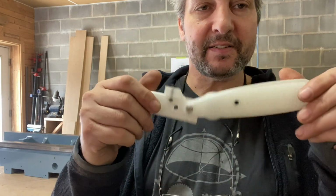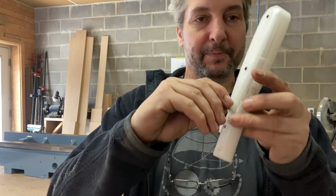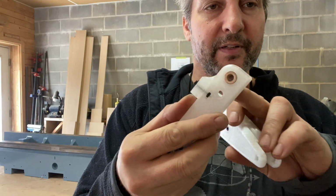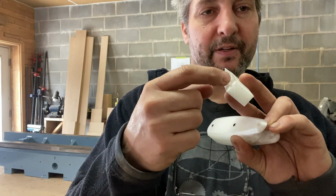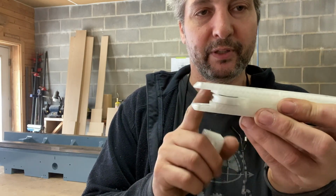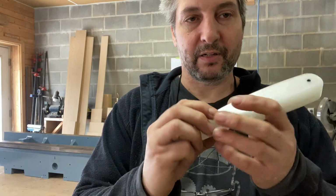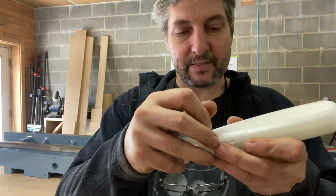Also, I've designed this little bender. It's pretty neat. It can be dismounted quite easily. You just pull out this shaft here, and there are brass inserts, and this part here holds the copper tube in place while it's being bent, and this pulley here is on bearing, and it has the 5/32 radius, and this will make exactly half an inch radius on the copper tubing, hopefully. Put the shaft back in place.